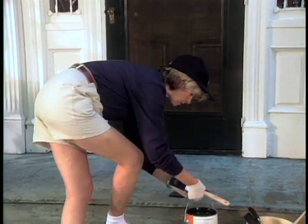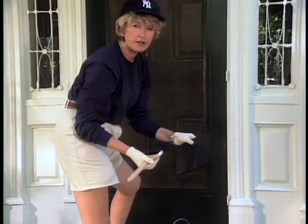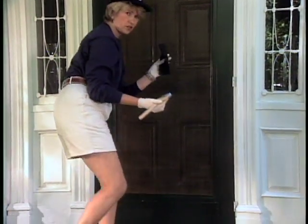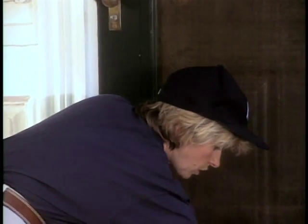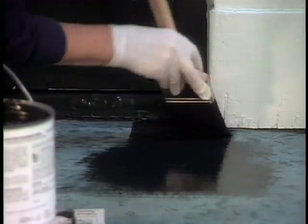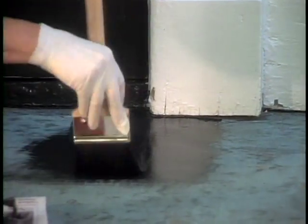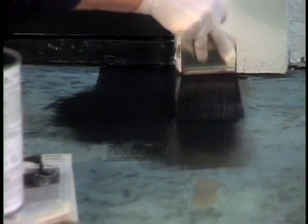Start on the top level if you're doing stairs — do the deck first, then come down and finish on the bottom stair. Work from the top down. I'm using a little rubber pad to protect my knees when I kneel. The first strokes of the brush are done in a criss-cross fashion to cover the entire surface area. Then do your long, even strokes in one direction to smooth out the paint so you don't get any strange lines. I learned all these techniques from Czester Kulpa, who was my father's cousin and a great fine painter from Poland. He painted cathedrals and even worked on St. Patrick's in New York City, always with his fine bristled brushes, painting decoratively and plainly like this.